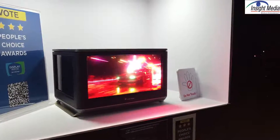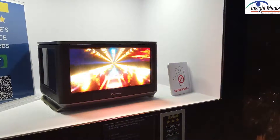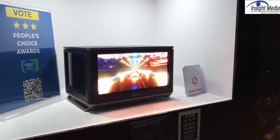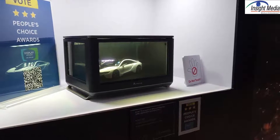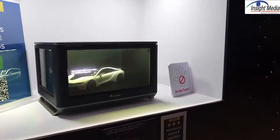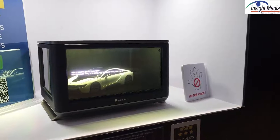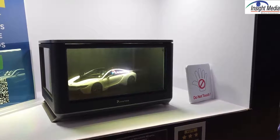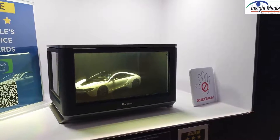This is the fully blocked mode — so we're looking at what's basically an opaque display, which is kind of nice. The 40% on the transmissivity side is a little low; I think you want to get higher than that for practical applications. But this is an interesting demo. This particular panel is a 9.38-inch transparent micro-LED display with a resolution of 960 by 480 and a 0.22 millimeter pitch — that's 114 PPI.